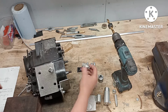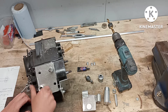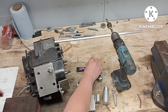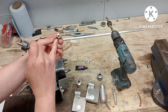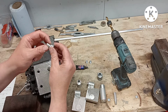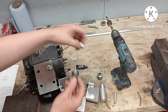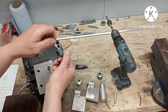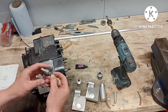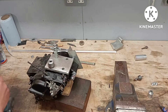Once I've drilled it I can use this tap guide - again it's about starting it off square since I'm not using a mill. Then I put my insert in: M12x1.75 on the outside, M8x1.25 on the inside. I gauged it with a nut going down - quite a tight fit, no wobble. The insert has a flat bottom, I apply a bit of stud lock, insert it in, and that should give me a good solid base to put the studs back in.